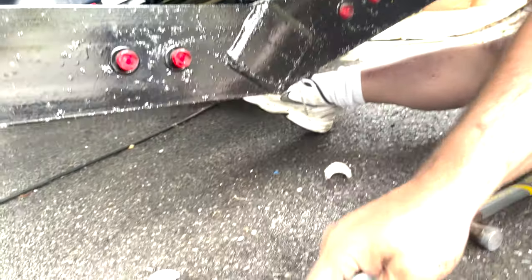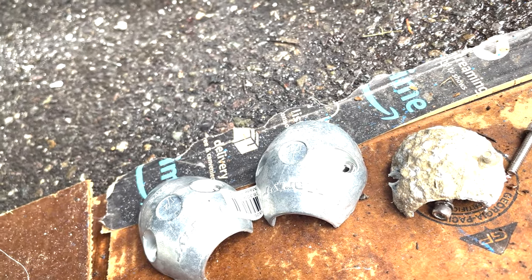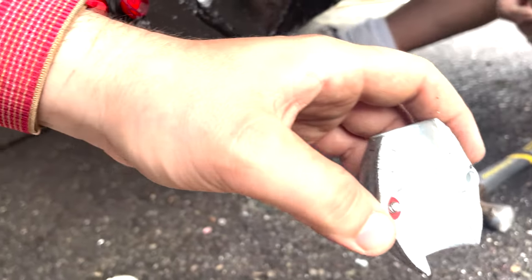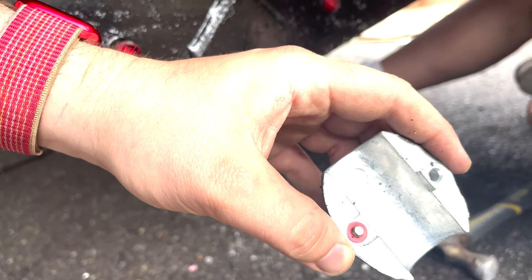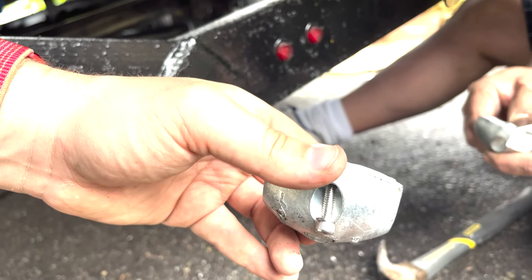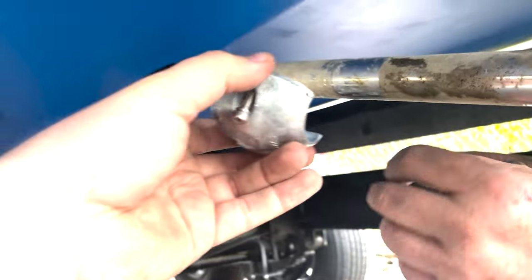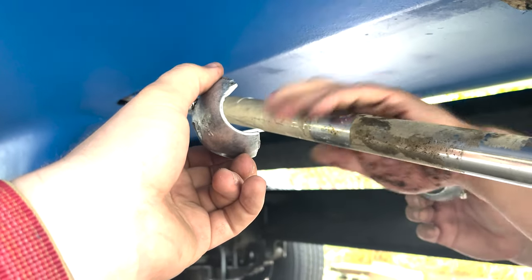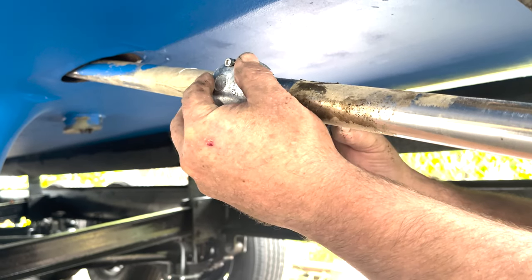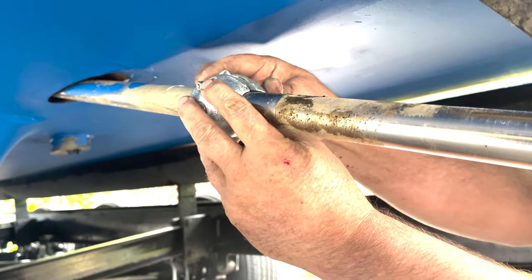See the difference? This used to be that before electrolysis ate it. Help with install. Make sure the plastic washer, it has to be there, and it will help keep the screw in place to aid with install. Want good metal to metal contact. Doesn't have to be perfectly clean, but make sure you're contacting metal to metal, not over the top of a bunch of barnacles and stuff.